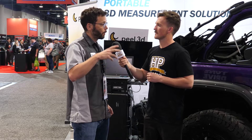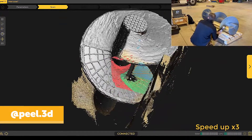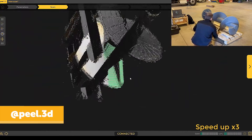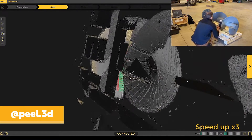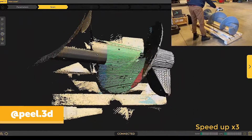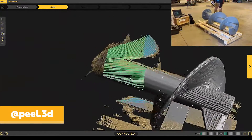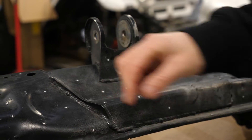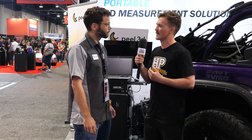Color can also be used to further improve the tracking capability of the scanner — it uses the geometry of objects, the texture of objects, and also these little marker dots placed onto the object to help further position it and keep accuracy. I wanted to touch on that — the process of actually scanning, because we often see these dots all over objects and some people assume you must have them to scan. What's the case here — what are these dots useful for?